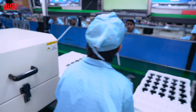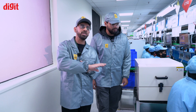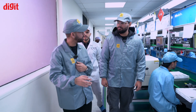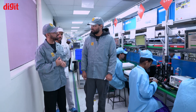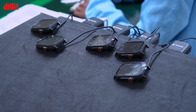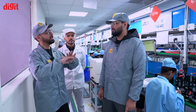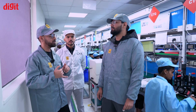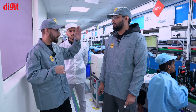We are now changing the UI. The watch comes with a user mode for regular use, but for aging there's a prerequisite software that runs automatically. The aging process goes for eight hours with charging on, testing the watch throughout. After eight hours, there is another process called stewing, which runs for 10 hours. After a total of 18 hours, if the watch passes — because it will be cycling through everything — it comes back for further testing.